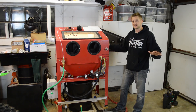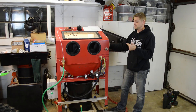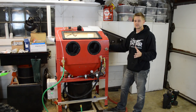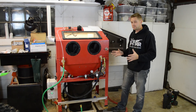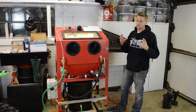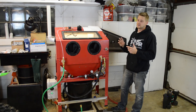Keep in mind that even if you get a Harbor Freight cabinet, you are not done spending money. There are all sorts of issues with it — the pickup tube sucks, the gun kind of sucks, the lighting sucks, and there's no dust management. So you have to spend another $200–$300 to improve the cabinet. At that point, you might as well build a wet blast cabinet. In my opinion, you can be vapor blasting for just a little bit more money over a Harbor Freight dry blast, because with dust management you need a dust deputy, a shop vac, and so forth.